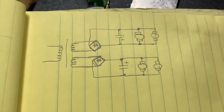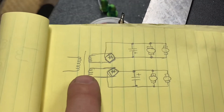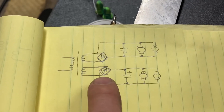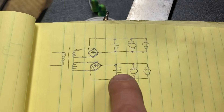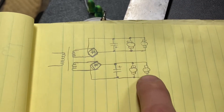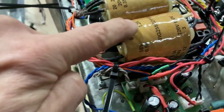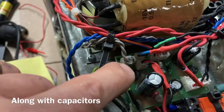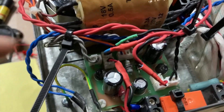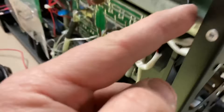The way the connection for these fans works is we have a transformer, two diode bridges, capacitors, and pairs of motors connected in parallel. So this is our transformer, the diode bridges — rectifying bridges — are over there, and the motors are connected right here.